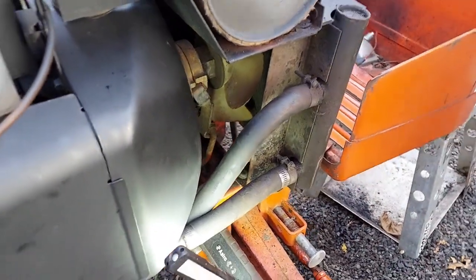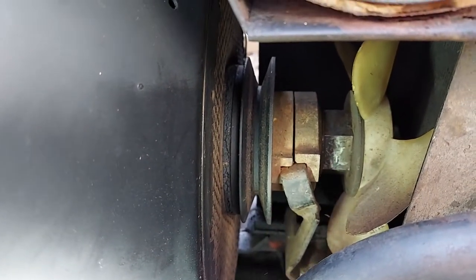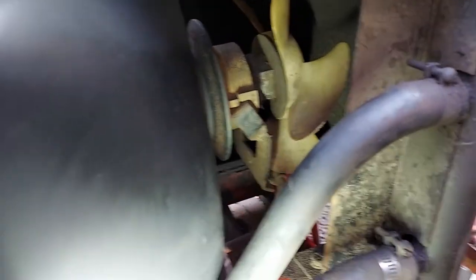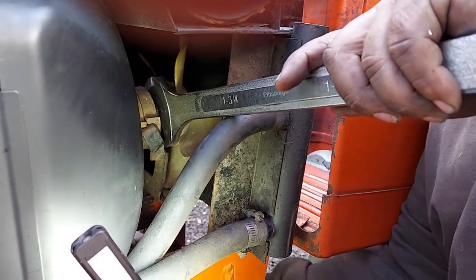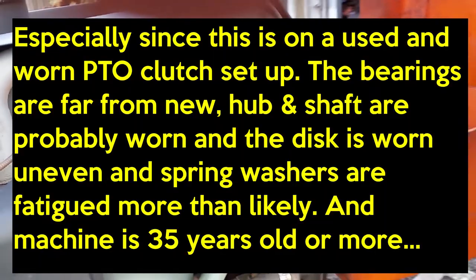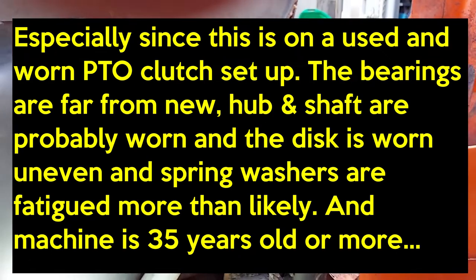This one took up quite a bit of slack so it'll need to get tightened up quite a bit. Cycle it and feel how the handle feels — it should be stiff but still fluid, and not fight you completely. It might be a hair tight. You can see the gap tightened up a little as we tightened it, and you have those distinct clicks, but the handle feels a little too tight. The handle is now in the off position, so just back that big nut off a little bit while holding the front nut tight. We don't always go strictly by the feeler gauges — it's a good starting point, but we go by feel so you're not bending the linkage and forks on the PTO.